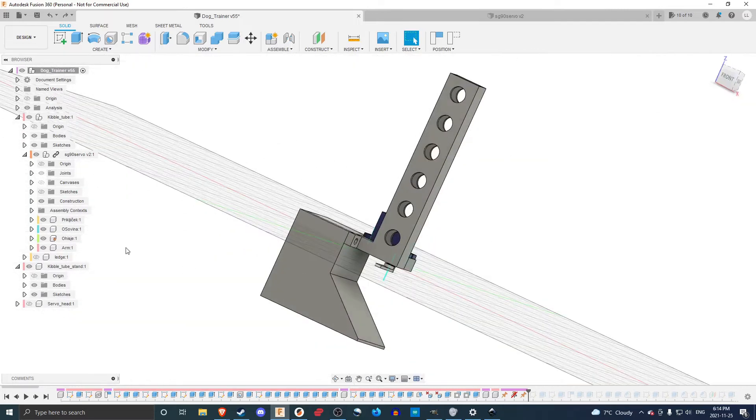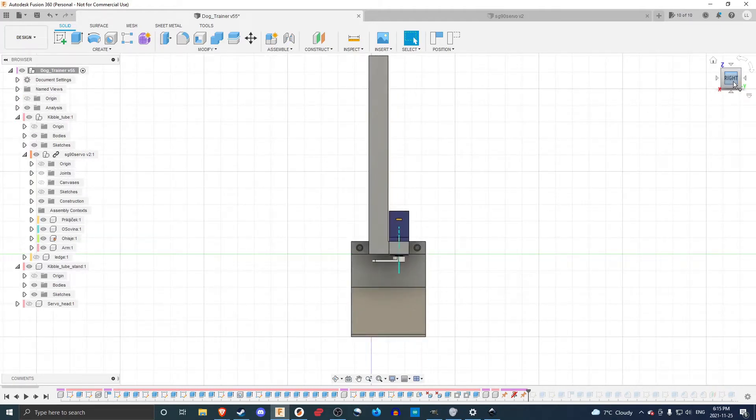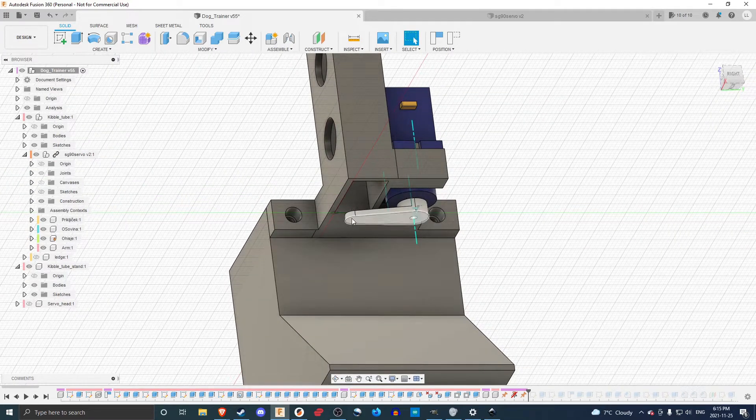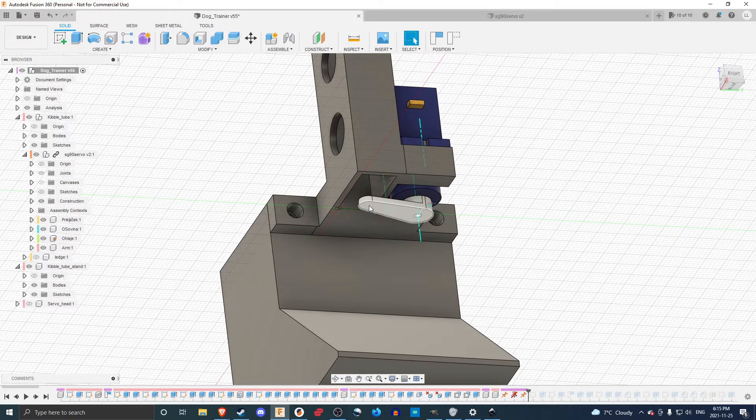The kibble tube and the stand are two separate pieces that were 3D printed and then mounted together using M3 screws, with mounting holes on either side. The thing is, using one servo was not very reliable because the servo arm just opens and closes like a gate — opens to release a treat and then closes again to block them. When you only have one servo, it's very difficult to reliably get one treat out at a time. I would often open it and if it didn't close fast enough, the entire tube of kibble would fall out. Or if you close it too fast, you don't get any out, or you close the arm as one is halfway out of the tube and get a jam condition.